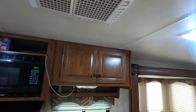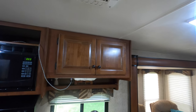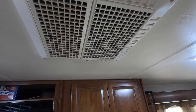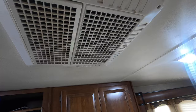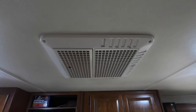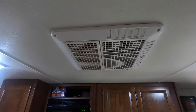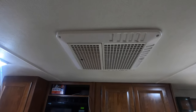That simply just means you've got a bunch of junk built up in there. Now, these filters in here are very coarse — they don't take care of much of the dust, so they build up stuff quite quickly when you use it continuously. If you have a long-term stay and you're living in your RV, you're probably going to want to do this once a month or once every two months during the warmer months.